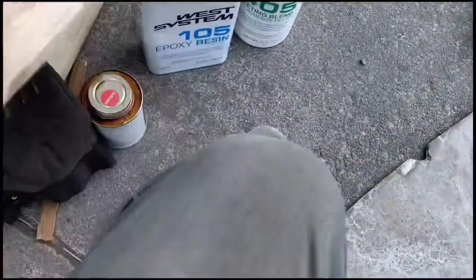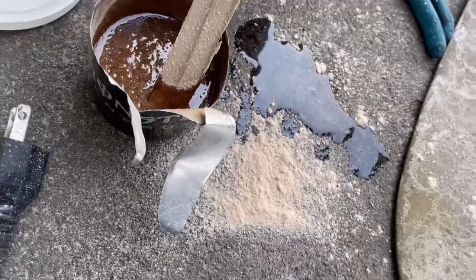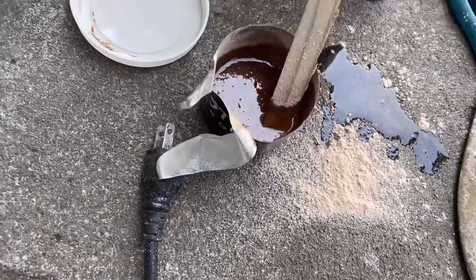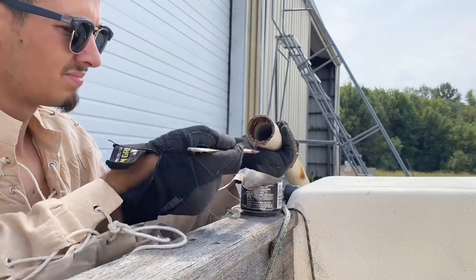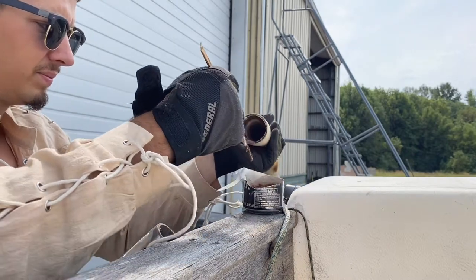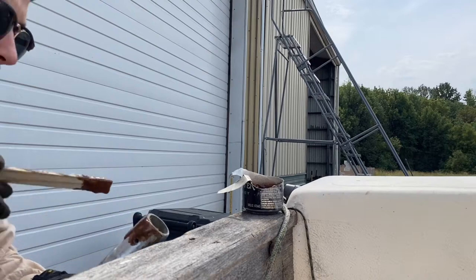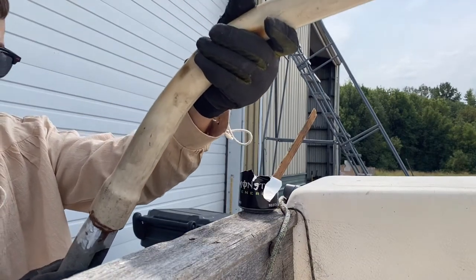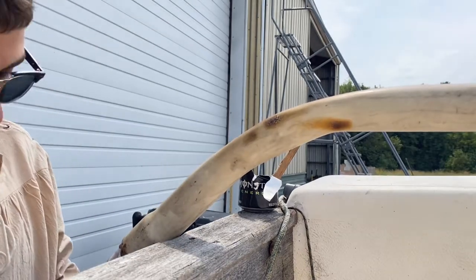Next step — we're gonna mix up a batch of epoxy and get this piece of PVC epoxied on, and fill these old holes. We added some thickener — also spilled some on the ground, so that's always cool. We're gonna wait for this to start kicking off a little bit, let it get a little more thick. Here we go — before this kicks off too much we're gonna add some to the inside. Really want a good amount in there because tillers get kicked around and reefed on. Line it up right — we may only be getting one shot at this.